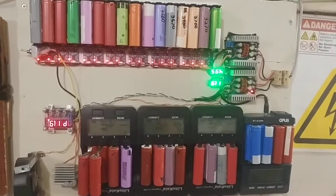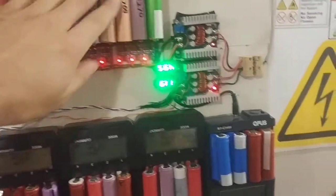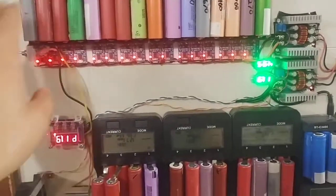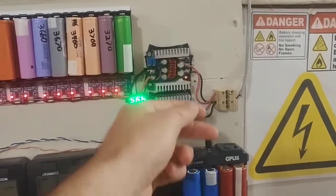Just thought I'd make a quick update and show you what I've run into — too thin of wire, for sure. Each TP4056 consumes somewhere over 500 milliamps. These buck converters are overkill, which is good because they don't get crazy hot.